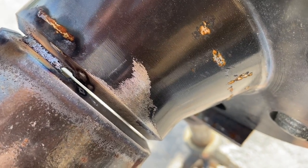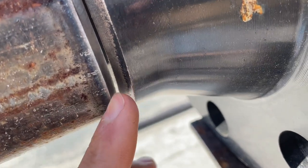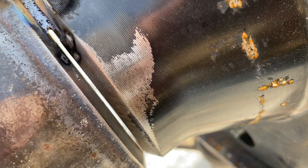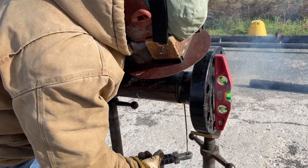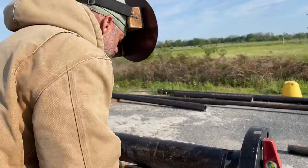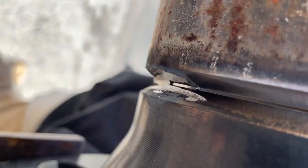Now you'll notice you can see through that bevel. So when you go to tack the bottom, look down here — I'll scratch it off right here, get it going, and then instead of breaking my neck looking under there, I'll just stand up and look through this and watch it go in from the top side because you can see the bottom from the top. Make sure your tacks are about an inch — if you put a big long tack on it it's going to be hard to get it level later. We just tapered it — we got up here just a little bit. We don't want to thin this out; when you come off it'll try to blow out and you have to fight it. Same thing on the bottom.